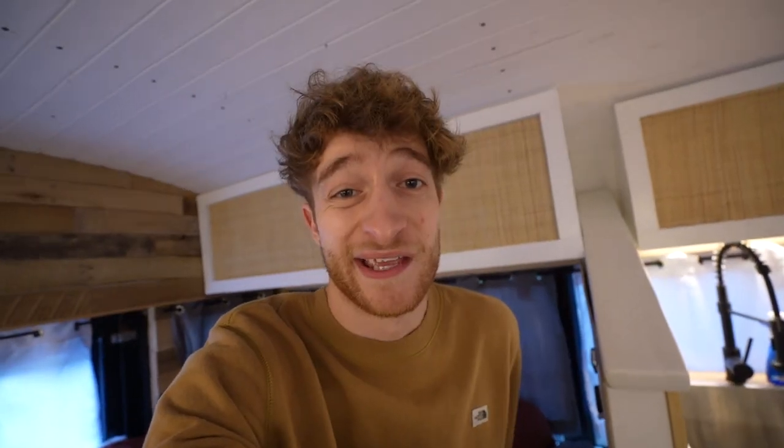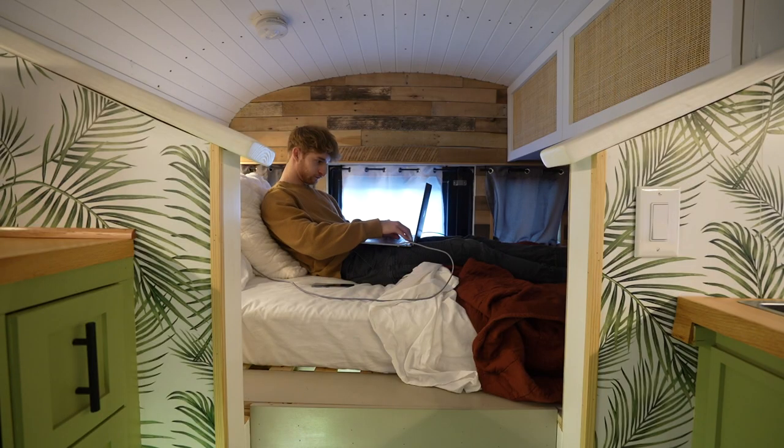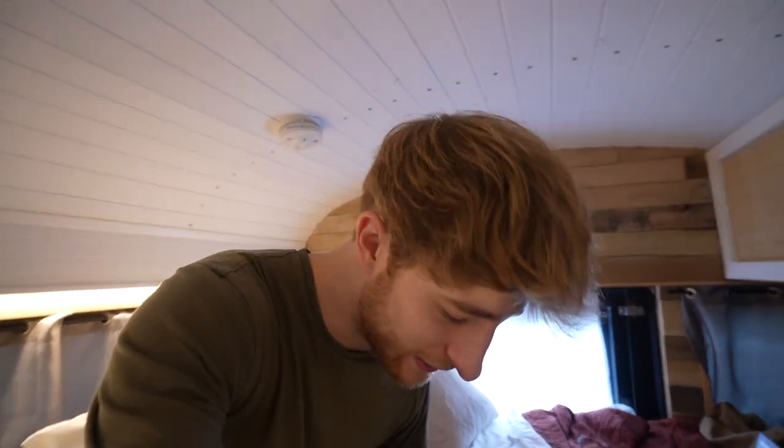It's set to 5.4, the max, and I'll check back in about 20 minutes. I decided to stay in here while it's running just in case anything happens. So far, still no haze. We're probably about 35 to 40 minutes in now — no haze. Before you could kind of see it on cam, but you can't see anything because there literally is nothing, which is a really good sign. I got it up to about 83 degrees in here. It's been about an hour and 45 minutes and there's still no haze. So I think it's safe to say the duct is probably the issue.